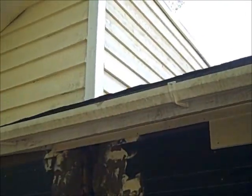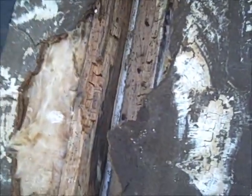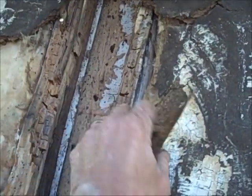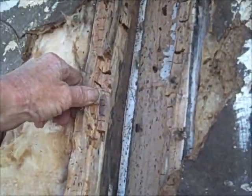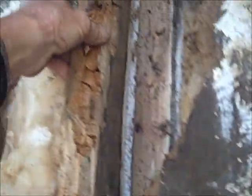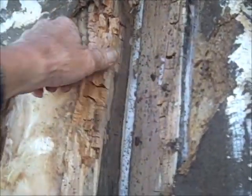Back down here on 23rd Street where we did the roof and had such bad plywood problems up there, and reframed that wall that they had never done anything with. They put this same insulation board back on the back of this wall. Now we got down here to the bottom — another rotted stud. That's a T right there. This is really bad. I mean, I could take that stud out with my hand. There's no way I could put siding back on that.